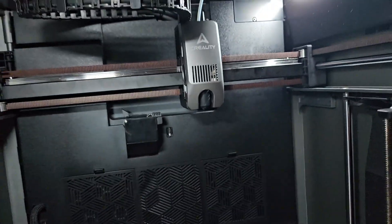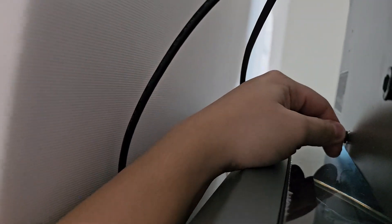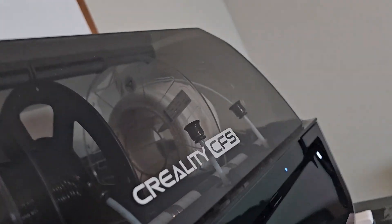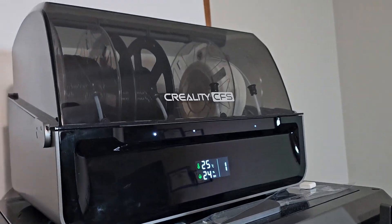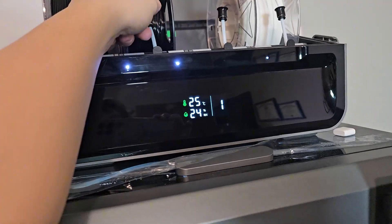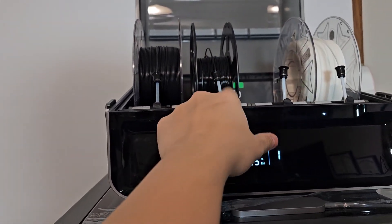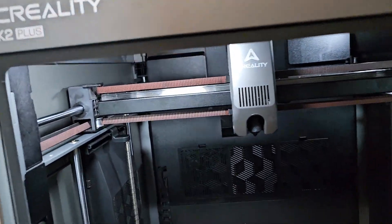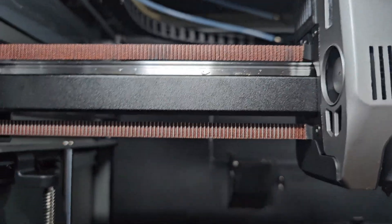What I'm going to do first is try to pull out the filament from back here. I'll take this off — I can pull this a little bit. It went to the middle spool now — it's the second spool now. I didn't realize that. Now that I just pulled the back filament, it switched over. So this spool is finished and it did change to this spool, but I think something just got jammed with the nozzle. It could be jammed here or at the cutter right here — it couldn't cut or something like that.